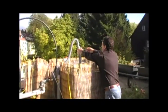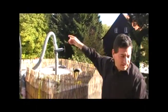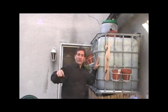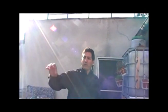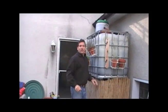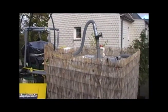When we don't want to use it, this valve here closes, sealing the biodigester, and the water instead fills the gray water container. Generally I'll open that when I'm using the Insinkerator, feeding the bacteria with food waste. When the gray water tank is low, I'll use just the bathtub water to fill it for toilet flushing and irrigation. Next spring we're going to reevaluate — we plan to move the biodigester closer to the bathroom so we don't lose heat through this long pipe. Ideally the biodigester will be right next to the bathroom window with the gray water tank beside it, which will make things a lot more efficient.